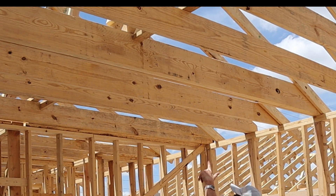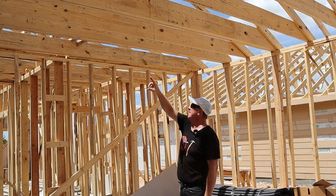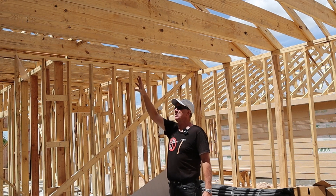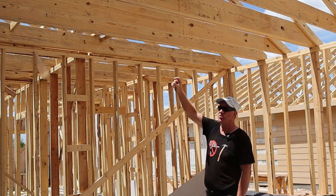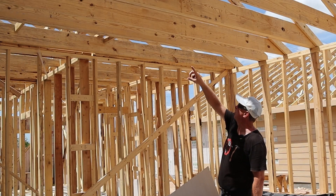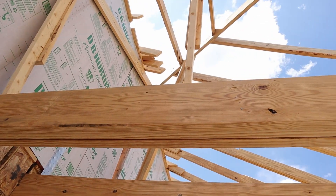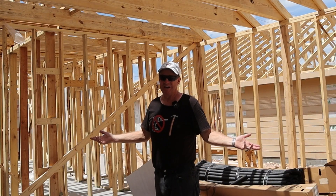Out in the garage it looks like two-by-12s, which is nice. As you can see, the bracing they've got here for the roof is spanned to a triple — excellent, so it doesn't bow. In my house they didn't do that, so I've got about an inch drop from the back wall of my garage to the center because of those roof strong backs causing them to bow. On these they put the strong backs on a triple, very nice, and you need to ask about that.